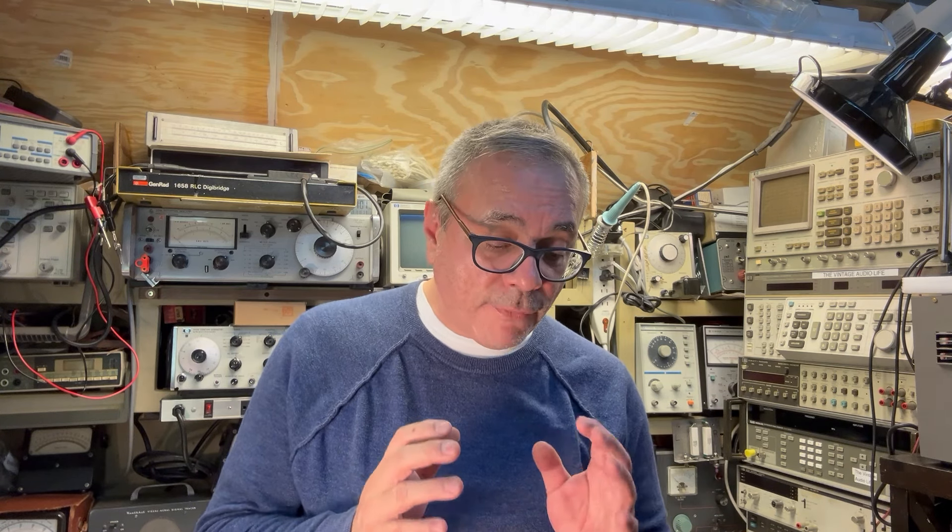Comment below if you have some ideas or if you're working on your amplifier and have issues you want to address. One of the biggest concerns for a lot of folks who build tube amplifiers is hum and noise. I'll talk about how to reduce that and address those issues, because I had the same issue with this amplifier. Wire layout is very important — in my opinion it's the most important thing when building a tube amplifier. Where to lay out the wire and how to lay it out matters, because you will pick up hum and buzz from the output transformer, power transformer, and the AC.